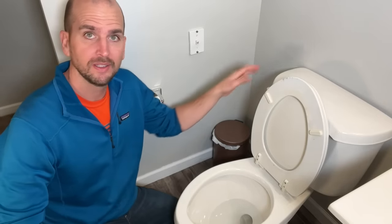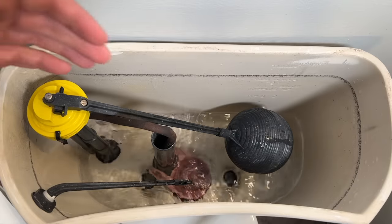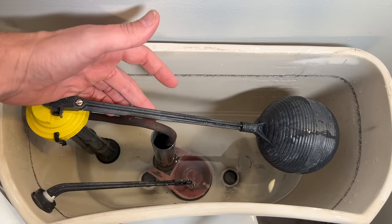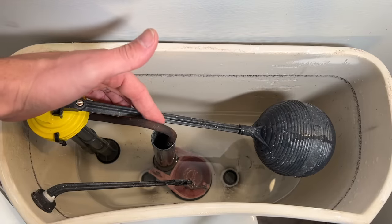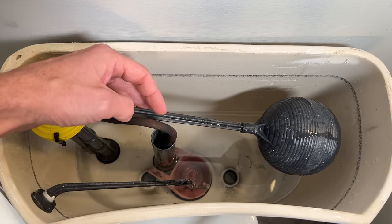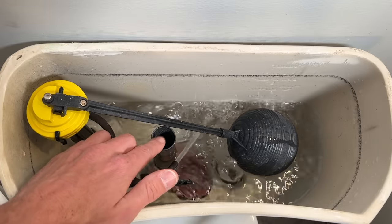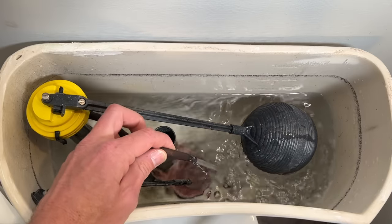In this scenario I'm going to flush the toilet and then immediately take off the tank cover. What I would do is just lift up on the float to cut off the water supply. You can pin something underneath the float arm to keep it in that position so it will not turn the water back on. But if you see the flapper is down and sealing off the tank, here's what I do: I take the refill tube that goes into the overflow pipe, take that off, and direct it into the tank instead. So I'll let the float down — now both the valve on the lower end is filling the tank and also this tube is filling the tank, and not putting additional water into the bowl of the toilet, which would be your problem.